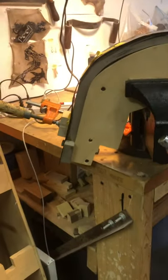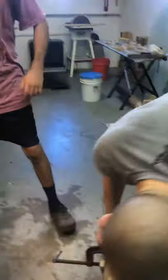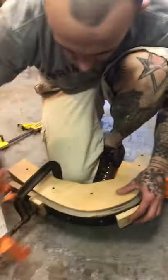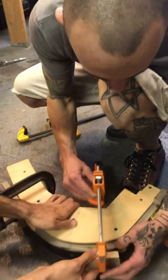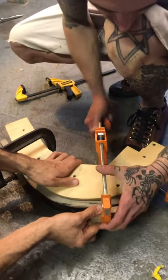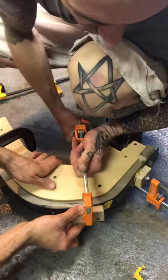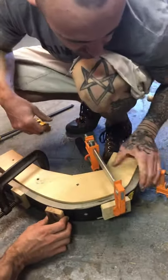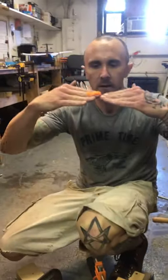Tell us about the wood you're using. Sugar maple. Sugar maple — is there a particular reason you choose this? Yes, because it accepts the glue that I use, the collagen-based glue. And what makes it so much different from, say, oak or pine? It's called a diffuse porous wood. Certain woods just don't accept the glue very well — it doesn't absorb well, or the shearing strength of the wood isn't very good, because these types of bows are under so much stress.